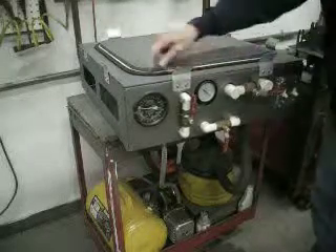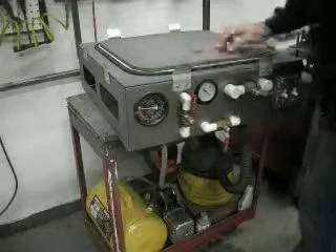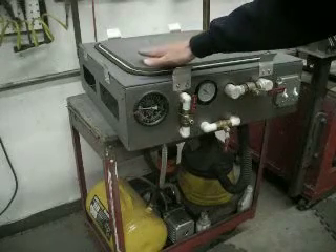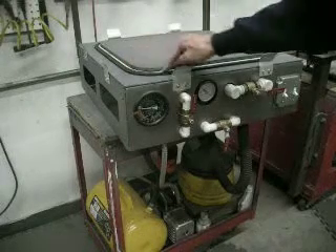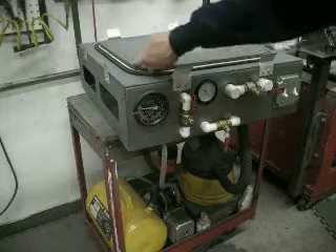This seal, I think mostly what I use it for is just to help line everything up — there's not really much of a seal going on here. The seal is actually your hot plastic making a seal against the edge of the platen. Once that's done, these seals really aren't even needed. So our hot plastic is making the seal against the edge here.